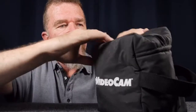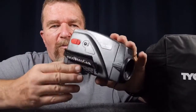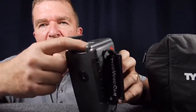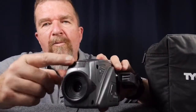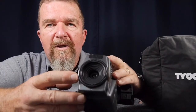In the 1990s, Tyco marketed this as the Tyco VideoCam, also known as the Tyco Kids Cam. It came in a little zippered pouch and has the appearance of a camcorder, including a rubber lens cap, a hand grip on the side, a sliding power switch, a red power light, and connectors on the bottom — one for video output and one for power. You could use an external power supply or six double-A batteries. There's a real microphone, fairly good quality for a kid's camera, and the camera itself is a small board camera — a little bigger than a postage stamp — a black and white, surveillance-quality, fixed-focus camera.